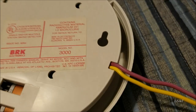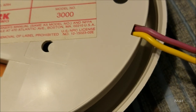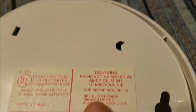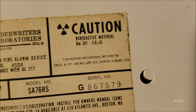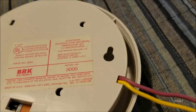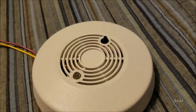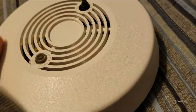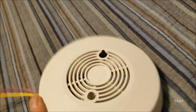Another interesting thing: this unit has the coffin-shaped sensor, but 77RS units with that sensor always have five microcuries of americium — this one only has one. That's another clue that it may be from very late in the 77R timeline. It also has the S-1208 marking that every single BRK detector has, even the ones made today.